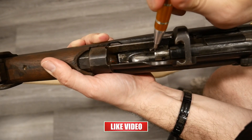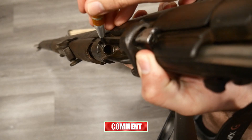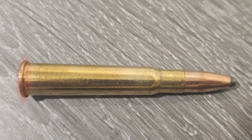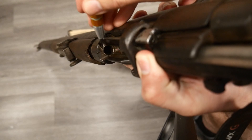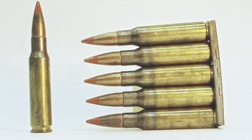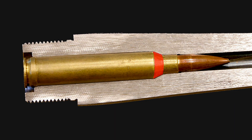But what exactly is headspacing and why does it matter? In simple terms, headspacing is the distance between the bolt face and the part of the chamber that stops the cartridge from moving forward. Where exactly that contact point is depends on the type of cartridge you're using. This Lee-Enfield No. 1 Mark III uses .303 British, which is a rimmed cartridge, meaning the headspace is measured off the rim — the raised lip on the base of the cartridge. The bolt face presses against that rim, and the rim rests against the corresponding surface in the chamber. But if you're working with rimless cartridges like 8mm Mauser, 7.62 NATO, or 30-06, the headspace is usually measured off the shoulder of the case — the angled part near the front of the brass. That difference is crucial when you're working on or building tools for vintage rifles.